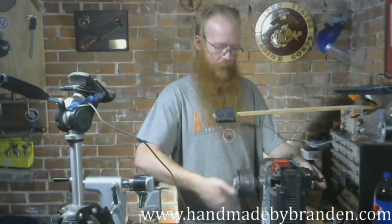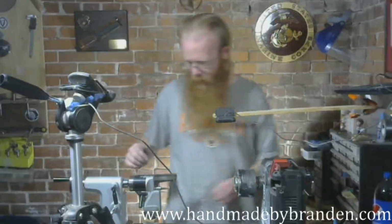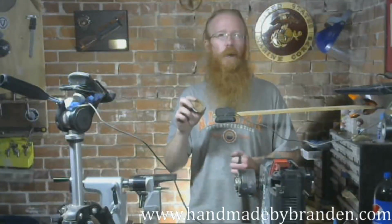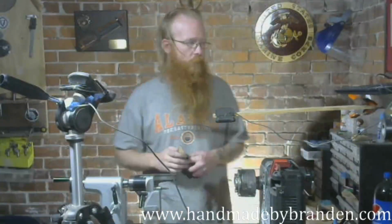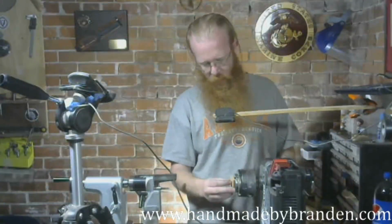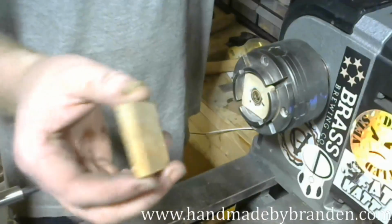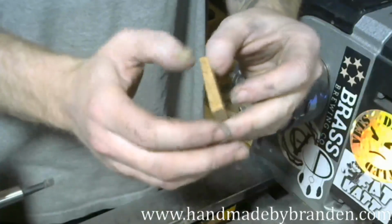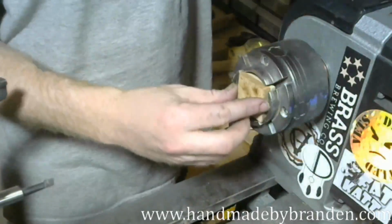If you don't have two chucks, that's okay. You can just switch your jaws out. Alright. This is just 50 millimeter jaws. This Amboyna is 1.5 by 1.5. You'll find most of your bottle stopper blanks in that size. So if you're looking to make rings, get bottle stopper blanks. It's a good alternative to what's called a regular ring blank, because those are going to be anywhere from 3/8 to half inch thick, somewhere in there, if you buy a ring blank. But you get a bottle stopper blank and you can make 7 or 12 rings out of it.